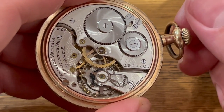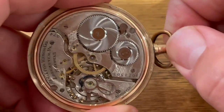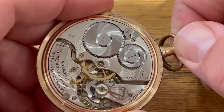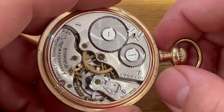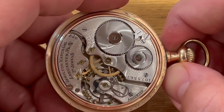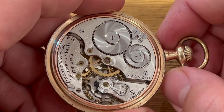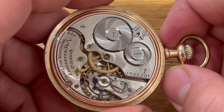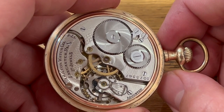So on a clock, the intention is you wind it up all the way every week; on a watch, the same kind of thing — there's a stopping point where you can't wind it anymore because the spring is tight. Putting a larger spring in a watch is never the solution. What's needed is service. If your clock or watch isn't running, that's because it's in need of service. Next time you see a clock or watch that's labeled overwound, you know that's just another fancy word for broken. Thanks for watching.